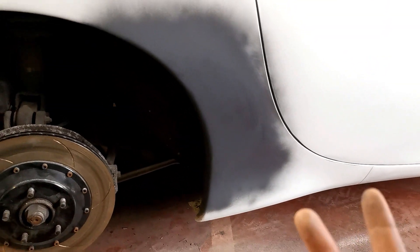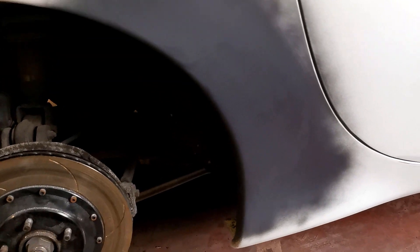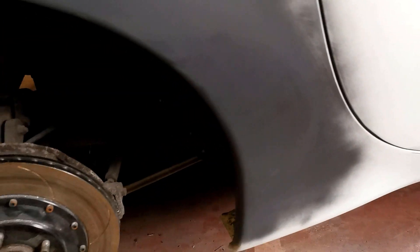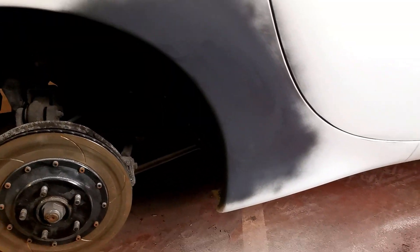So this is where we're at now — two coats of filler, blocked down first with 80 grit then up to 240, and I've just put a bit of primer over it to see where we're at. It's pretty flat to be fair. That's it for today — we've done the rust repair. Next video we're taking the doors and hatch off and concentrating on getting the shell painted. Going to put some epoxy primer on it. I've got a couple of free days this week so hopefully we can get a decent coat of primer on and maybe even get it blocked down. Once it warms up to 15-20 degrees we can get base coat and lacquer on. Thanks for watching and I'll catch you on the next one.